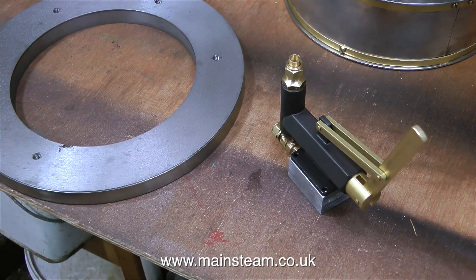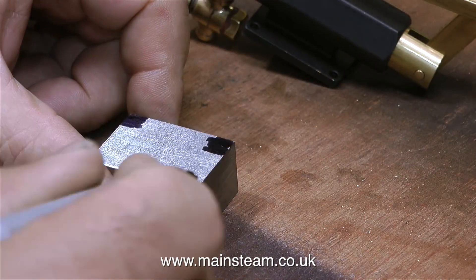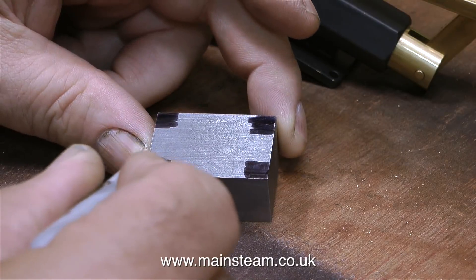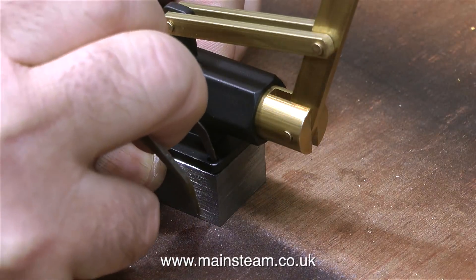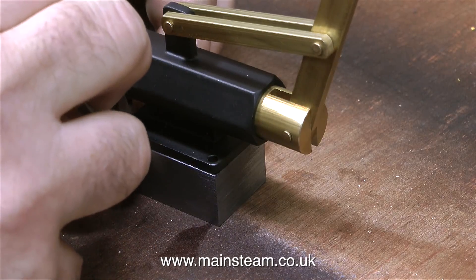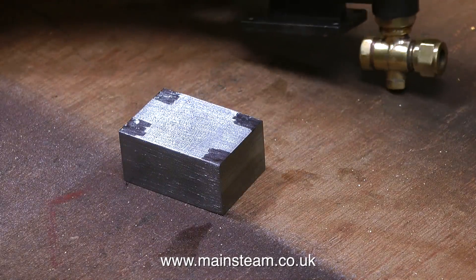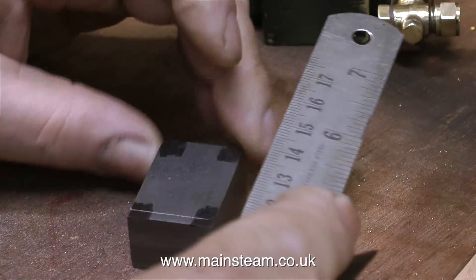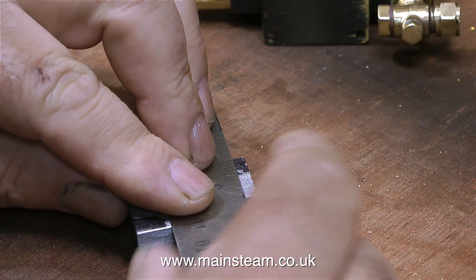Now that I've finished the block, the pump is sat on the block. I'm using a felt tip pen to blacken each corner of the piece of metal, so that when I scribe the marks through the holes of the pump, I'll be able to see them. I do not have a right-angle scriber — note to self: next time I go up to Black Gates Engineering, buy one. I'm currently using the points of a pair of tweezers, which is not ideal but does the job.